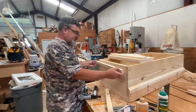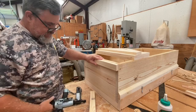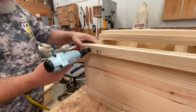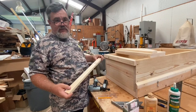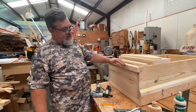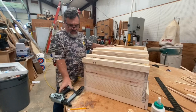Did I mention it's hot in here? Does anybody have an old furnace blower, or know an HVAC guy that wants to support a YouTube channel? Because it is toasting. Now we're going to put this trim piece flush with the top. This hive is getting really heavy. I cut a piece of one-by-four to the correct length of the width and ripped it down to an inch and five-eighths.